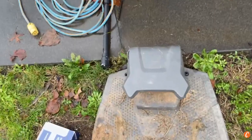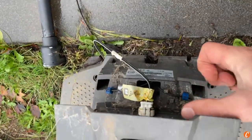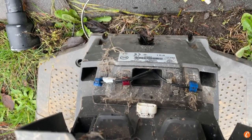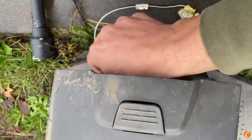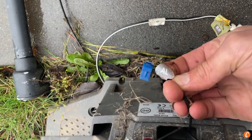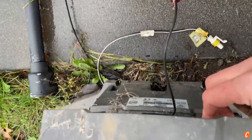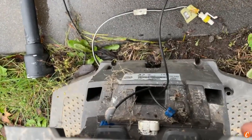So we've got to open this up on the back — open the lid. There's a button on the back and you can lift up and open the lid. The first thing is let's get the power disconnected. This one has three wires: it has AR, AL, and a guide wire. Some of them are going to have up to five wires going behind them, so we're going to just unplug those. Good first thing is to make sure that the wires are labeled, because this is something you may not remember in the spring. This one has an AL label, this one has a guide wire label, and the other one has an AR. If it doesn't have a label, get a piece of duct tape and a permanent marker and let's get those written on. So those are unplugged.